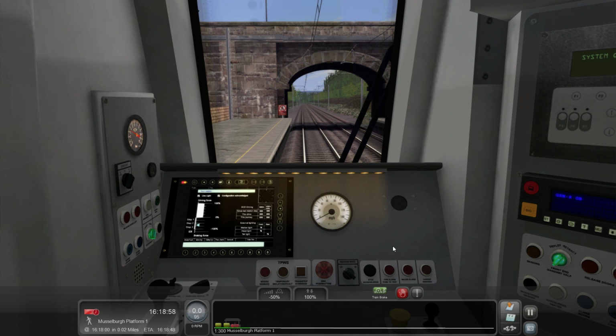The emergency brake is still fully available as this is hardwired. If the alarm sounds and you are about to have or initiated a braking for a station stop, signal, etc., immediately apply the emergency brake and stop the train. After stopping, report fault to signal and carry out fault analysis.